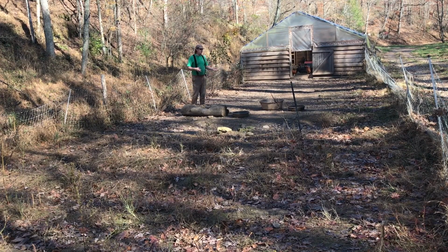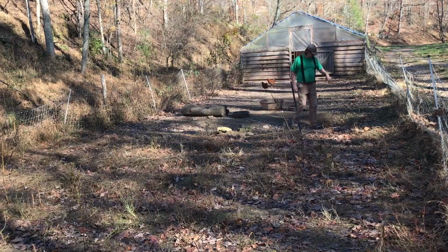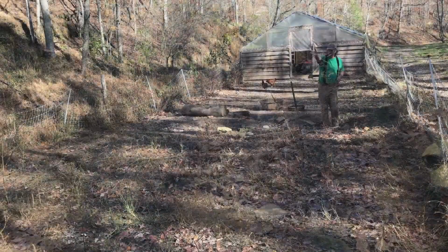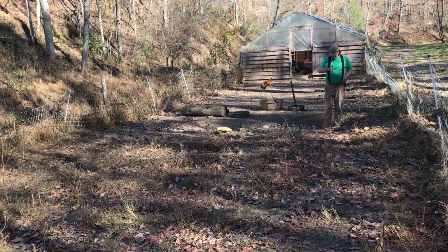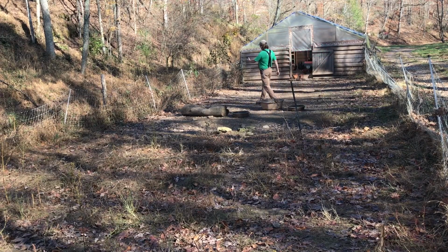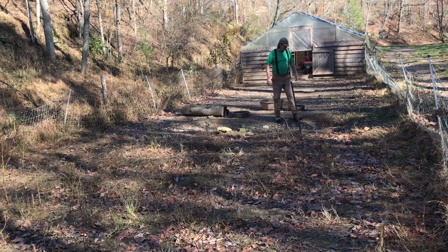And the reason why I haven't moved them is where I'm standing is actually fill from the old creek. In fact, I'm standing at the exit point of a culvert right here. They used to dump into the creek, because the creek used to come down right to the left of the camera, turn at this culvert, and it had a really bad bank it was eating into. It turned and came right back out here and then got into the creek. So we filled in this S-curve, if you will, made a straight shot all the way back and reclaimed this little small piece of land.